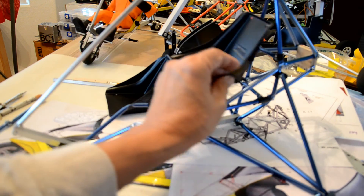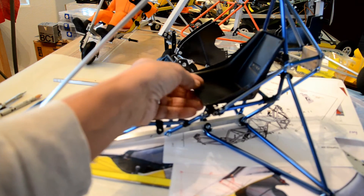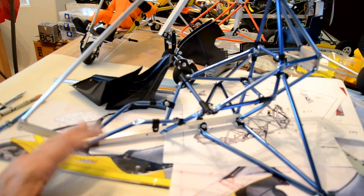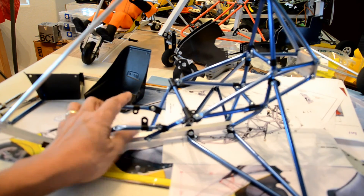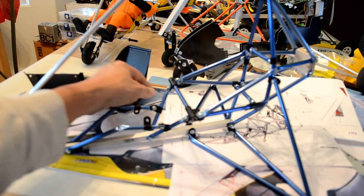The ends are drilled and that's about it. If I need to connect to the center of a tube, I don't drill and use a bolt through there — I use a clip. I've seen some people drill through plates and tubing for seats and things like that, and when you drill that you weaken the surface — it's just not the way I like doing things.